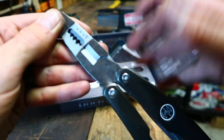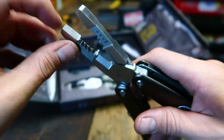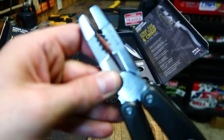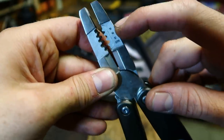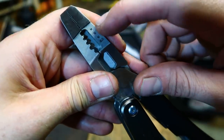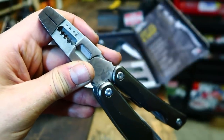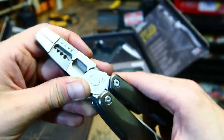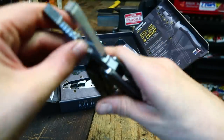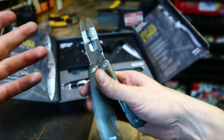On the head, you have a very narrow cross-hatched lineman-style jaw, which you could definitely twist up some splices with. Then you have three stripping gauges: 16, 14, and 12 stranded on one side, and 14, 12, and 10 solid on the other. That covers 95% of everything I strip anyway — mostly 12. Then you have some decent cutters down here. They cut just fine — they are chisel tips, both of them coming together to make the cuts. That's the pliers part of it.